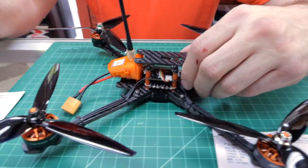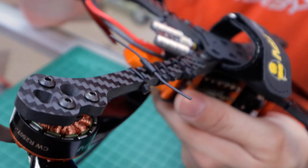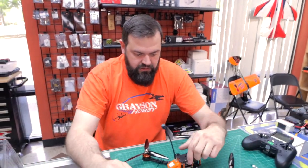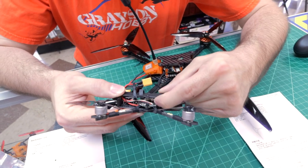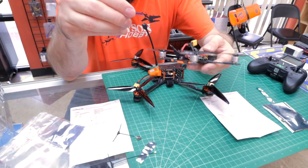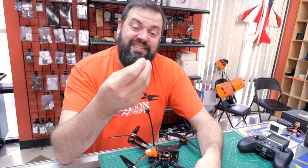This little receiver — I just tucked it in here because it fit, then ran the wire here. I was rushing to fly between customers, so this is not a super secure location. For someone brand new, it's just four pads: RX, TX, 5V, ground. On something like the Baby Ape drone, it'll be really easy to access those pads. There's plenty of room even on a small drone — this receiver is tiny.